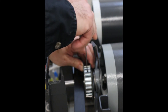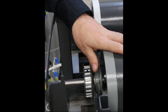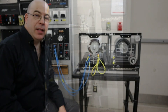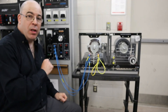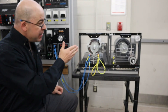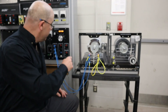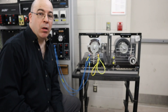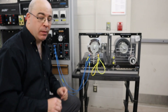This ensures that any future project undertaken using this combination of electrodynamometer and squirrel cage induction motor will run smoothly. Now that we've taken the time to properly align our pulleys, making sure that they're both co-planar, I'm going to turn on the power supply and run the machine to see if the belt is tracking better. Here we go — and as you can see, the belt is staying exactly where it should be, riding between those two idler pulleys, maintaining tension. This is going to operate extremely well. Until next time, stay safe.